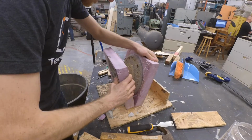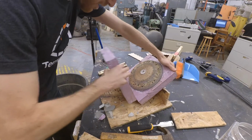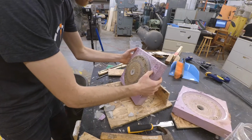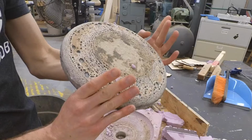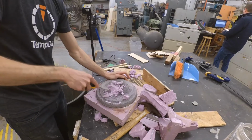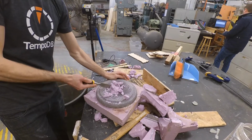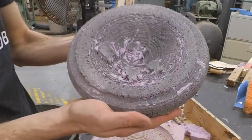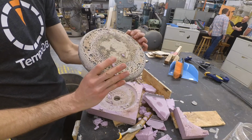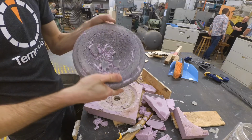The bottom surface had sort of a weird texture and a lot of bubbles in it, and the very bottom never hardened completely and sort of had a clay-like consistency. I thought it was because I maybe hadn't mixed the concrete well enough, but I wasn't 100% sure. Also, the foam on the inside of the bowl was really hard to get out. The concrete's texture wasn't as smooth as I hoped it would be, so I knew I would need to do something to make that surface finish better, and also to make it easier to pop the concrete out of the mold when it was done.